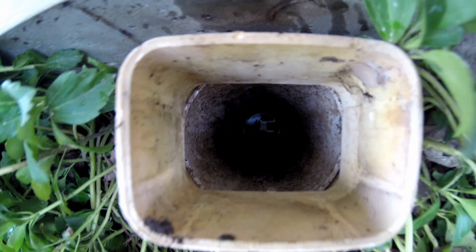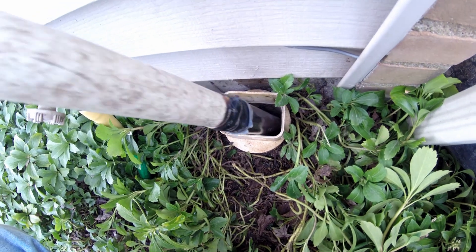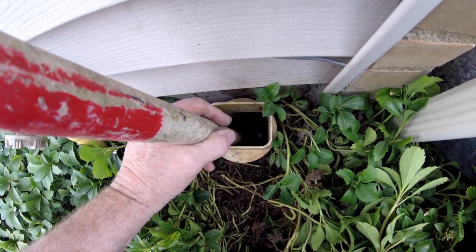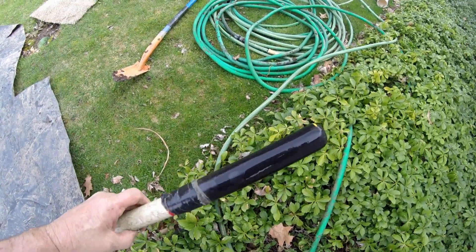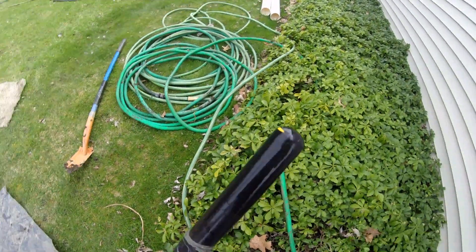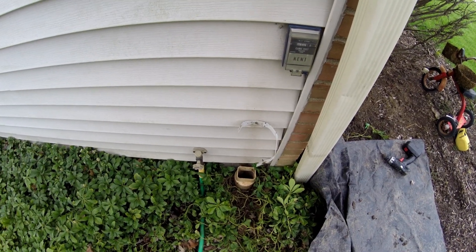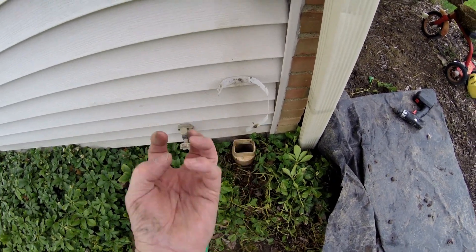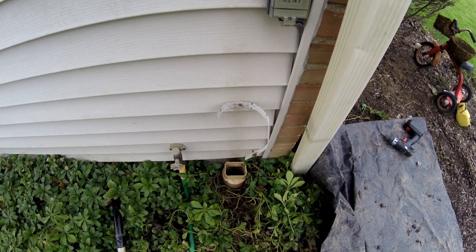If you look down in there, that pipe is full at least up through the 90-degree elbow. This is four-inch pipe. I'm going to stick a shovel handle down in there to see just how much water it's holding. It's holding water all the way up — about five, maybe six inches. That's how much that pipe has sunk down. It's still moving water, but there's separation between the pipes, and in heavy rains it just can't push all that water through to the main line. It backs up, and since the pipe is actually sloped back towards the house, gravity's not working in our favor.